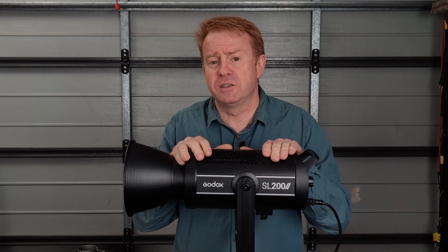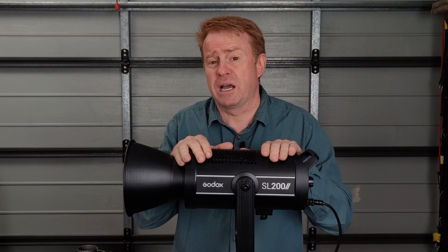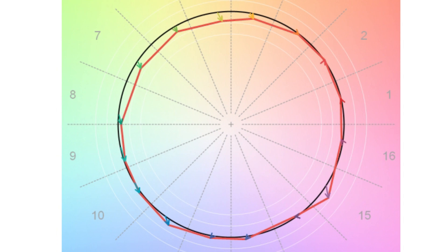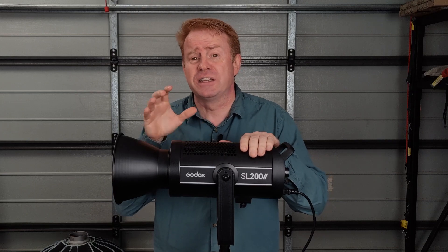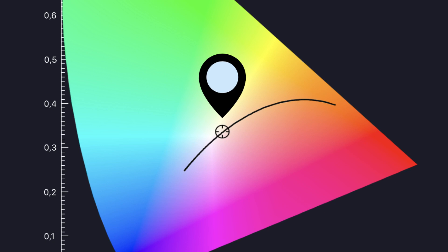The next positive is the color render. You're looking at a 93 TM30 color vector score, which is very respectable and actually better than the color render scores I get on the COBs I'm currently using. Right down at 10% that drops to a 91, which is still very respectable. Color render is meaningless unless the light has a good white point, and these actually deliver on that. With the reflector on it was very close to the Planckian curve — the worst deviation was at 10% and even then still within a 1/8 correction gel.